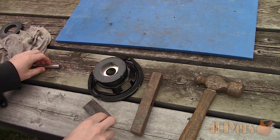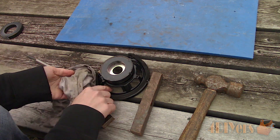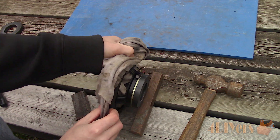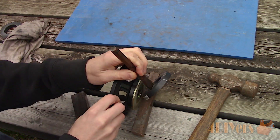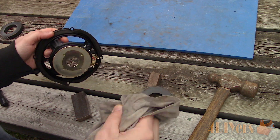And as you can see, the portion has been removed. Again heating the area, we're on to the final part of removing the magnet. Using a chisel with a sharp edge, separate the area between the magnet and cap on the rear of the basket. You may need to work around a couple of areas depending on its bond. Once removed, here is the magnet ready to be used for another application.